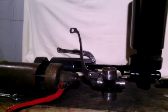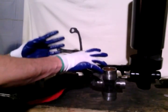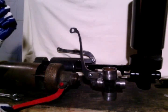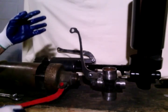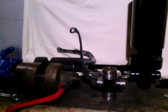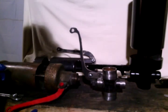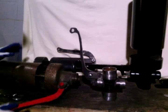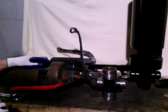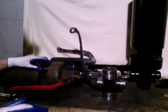Other people have asked me about other whistle valves besides this spring-loaded whistle valve, which is pretty much standard to what you'll find on the market — whether it be half-inch, three-quarters, one-inch, or inch and a quarter. The two-inch whistle valves have been harder to find, so we started making them ourselves. People with larger locomotive-style whistles, if they've had one made by another manufacturer without a valve, we can offer them a valve with different style handles. The other type, used by railroads, is a valve-bowl combination — some of you have seen me build this with the Southern Pacific 6-chime whistle I finished recently and sent to North Carolina.